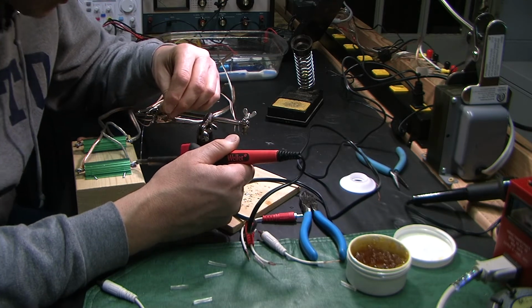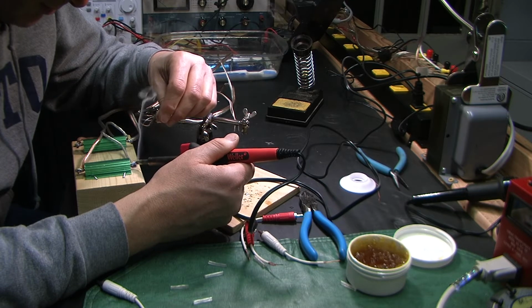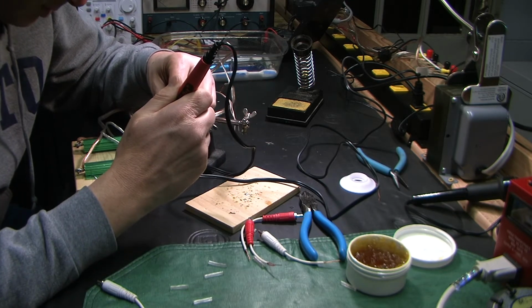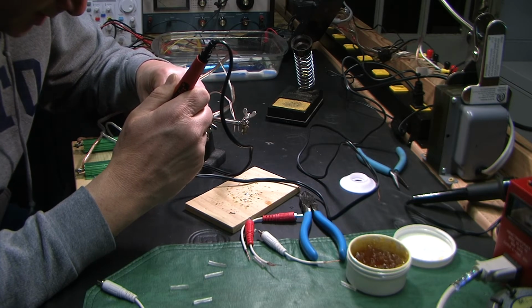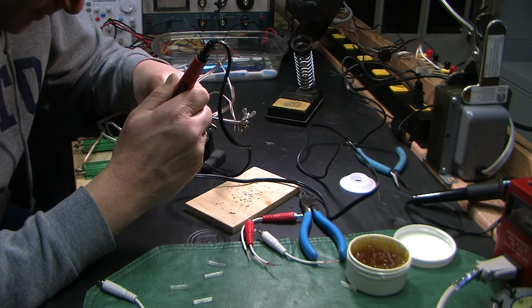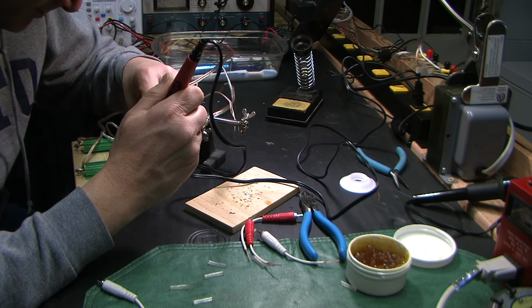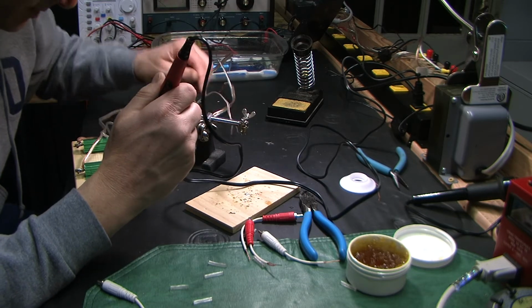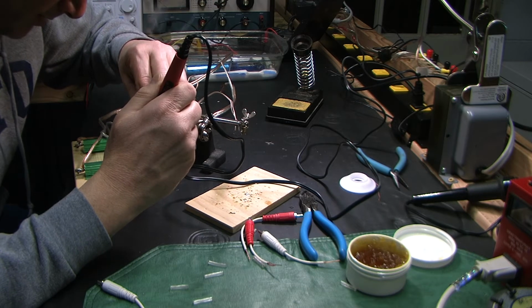Beta was the gain, but with the Darlington pair, if you have two transistors, you multiply the betas together, so you get kind of the square of the gain, the current gain, that is. And there are some other advantages to it, and a couple of disadvantages, but they all look the same.